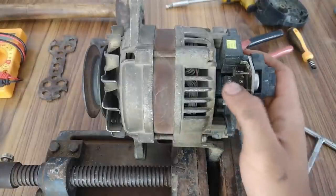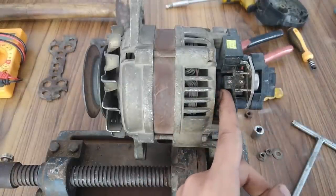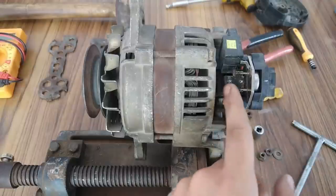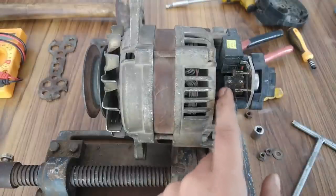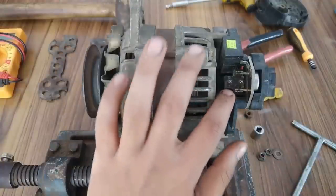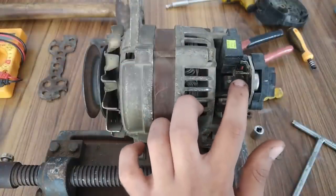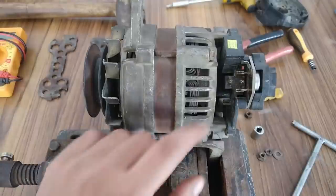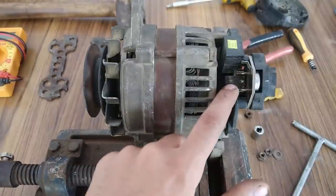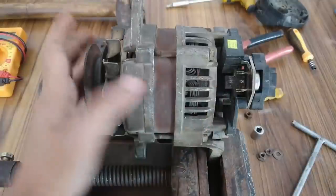So as you can see, this portion is out, and this box is for the brushes, I guess. The brushes are connected to the slip rings. So I'm going to check if the brushes are worn out by connecting a 15 volts DC supply. I'm going to give a 15 volts DC supply to this and this terminal to feed the brushes